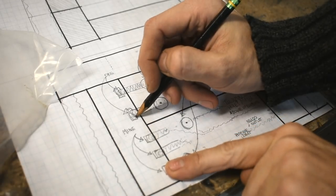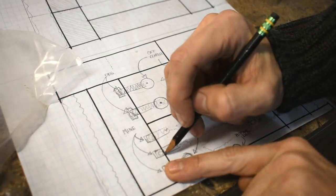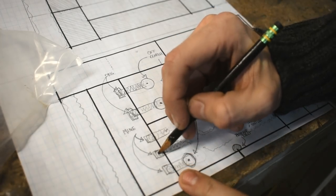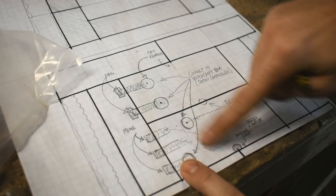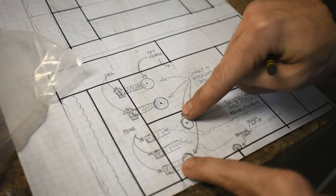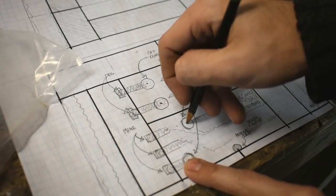I also can't make quite a large, wide T shape. So I'm just going to make one groove just wide enough for the element so I can fit another one in the middle. Again, here, staggered, because they're going to have to go around and wrap up. They're probably going to be staggered more than this, but the hole that I'm going to put through is quite small, so I could probably get away with that.